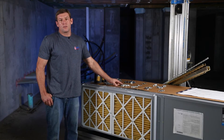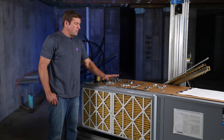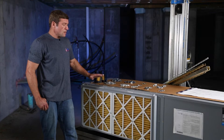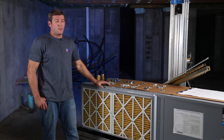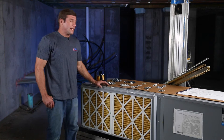Normally an air handler we can use quarter inch lags. A dehumidifier we can use quarter inch lags. We go up to something heavy like this geothermal unit here which could weigh up to 500 pounds — we absolutely want to be using a three eighths lag or something. So do your research. Make sure that what you're using is strong enough to hold the weight of the equipment, but also allow some tolerance for somebody to do something like hang on it. If somebody's in the attic working they might step on it and put extra weight on it that you didn't account for.